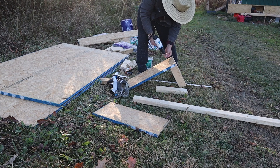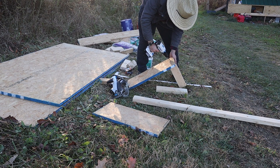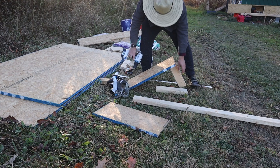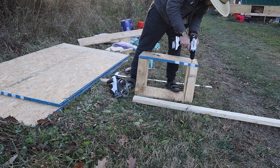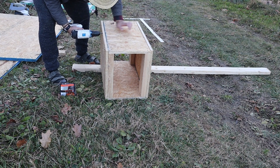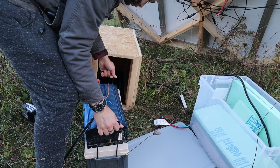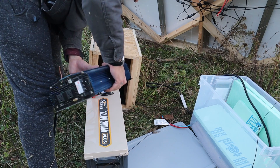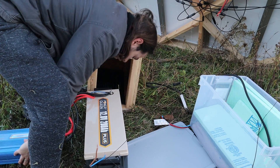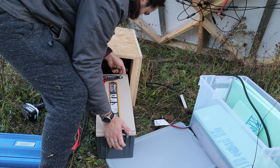Because I'm putting the battery and the inverter outside with the solar panels I need to protect those, so I'm making them a little safety box. This box will also be big enough to hold a few layers of insulation. A little quirk of lithium iron phosphate batteries is that if you try to charge them below 32 degrees you cause dendrites and can break your battery. So to keep it from freezing I put a seedling mat in the bottom of the box and added insulation, plus the inverter should add heat, so I think the battery will be okay outside.